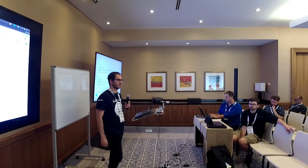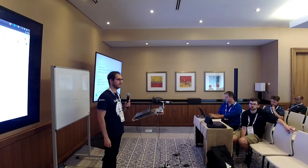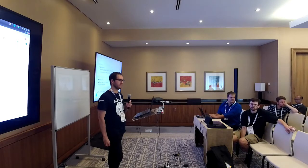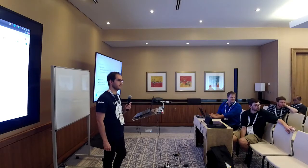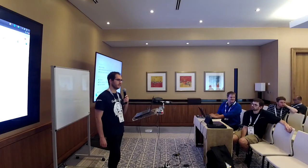If you're going to start talking about wireless, there's lots of wireless protocols: 15.4, Bluetooth itself, IPv6 over Bluetooth, all sorts of stuff that really do work well and are being used in the IoT space right now. But what I'm hearing is this is about how to talk to a microcontroller to run some GPIO pins that might do SPI to a temperature sensor, and we need an interrupt somewhere back, right? Yes. And I'm just trying to understand, when would you really use this in this space?